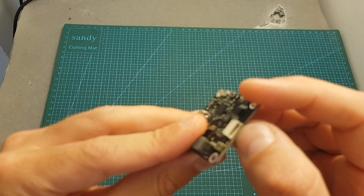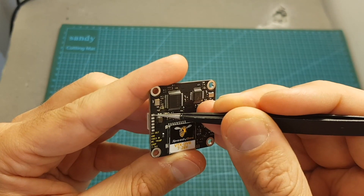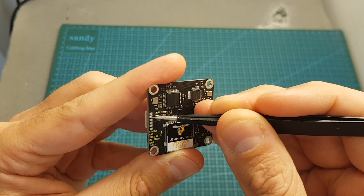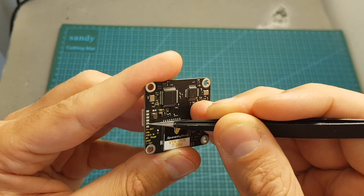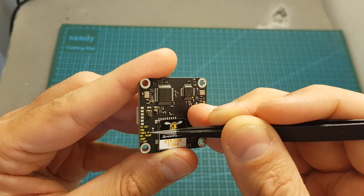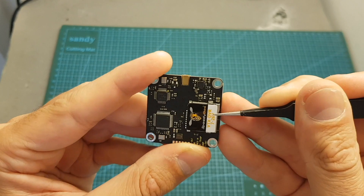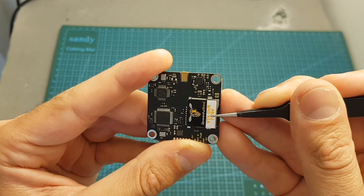The DVR button will also enable you to format the micro SD card. Connecting the VTX to your flight controller can be done either with the six-pin port or by directly soldering it to the bottom of the VTX. The top pad is the +5V, then ground, video in, the Smart Audio pad, then ground, and finally the battery pad. The working voltage is between 7 to 26 volts.